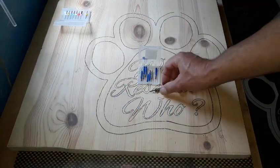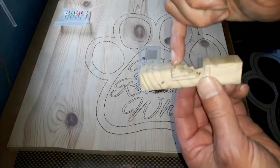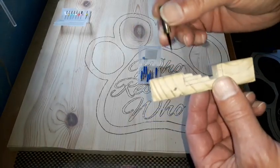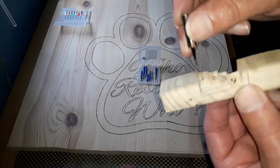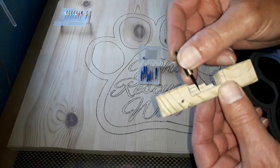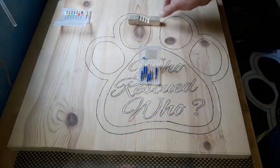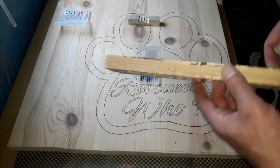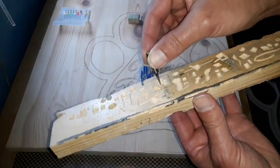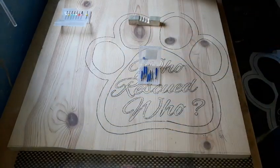We'll set it to a knife depth that we need. My two little devices, this stepping down mechanism. So you will set the router mechanism, should I say, to this step down piece of wood, so you can see the depth there. That's one. Would two be deep enough? Three is far too deep. Four, too deep again. So that's a little idea. They come in handy. There are proper depth gauges you can purchase if you want to be technical, or a good old classic piece of wood like that. Set it to one you like, mark it off, and you know you've got the same depth for your project.